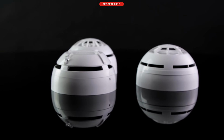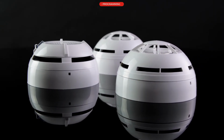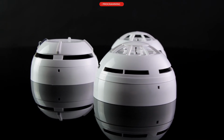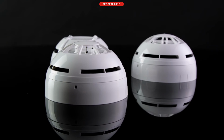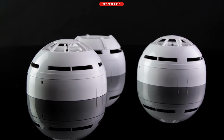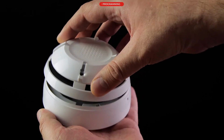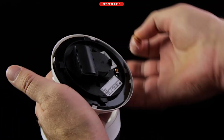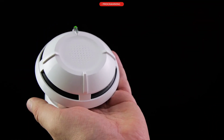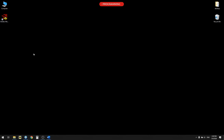The device can be programmed using the free software Streletz-Master or via Translator module menu. Let's consider programming via Streletz-Master using ARG-WL8O as an example. Prior to programming, the detector should be powered up. Remove base from the optical smoke detector, remove battery clip and isolating battery tab, and refit base. To program the detector, launch the Streletz-Master software.